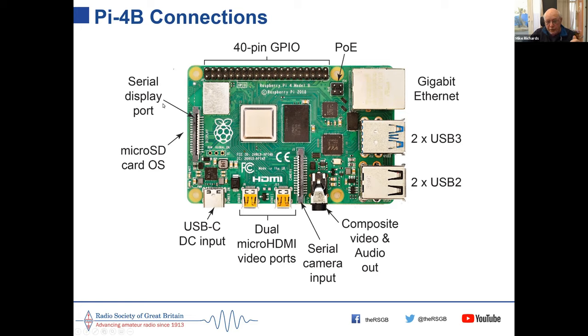There's a connector for powering a special Raspberry Pi 7-inch touch screen display, with a ribbon cable connecting to it. Along the top are the 40 input/output GPIO pins — you can make them go high or low to switch things, or use serial communications through them. At the end, the PoE pins are where the power over ethernet board connects. There's an awful lot packed into this board.